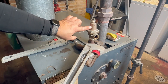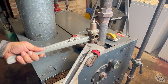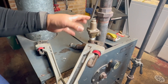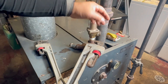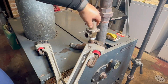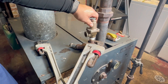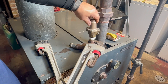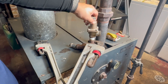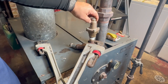Now to remove the valve itself, we have to protect the pipe with the bigger wrench, then use the smaller wrench on the valve. At this point we shouldn't have much pressure, but just be careful. Don't take it all the way out — just loosen it a little bit first. If there was any pressure it would come out of the seam here. Looks like we're good. You can see it's a little bit rusted inside.